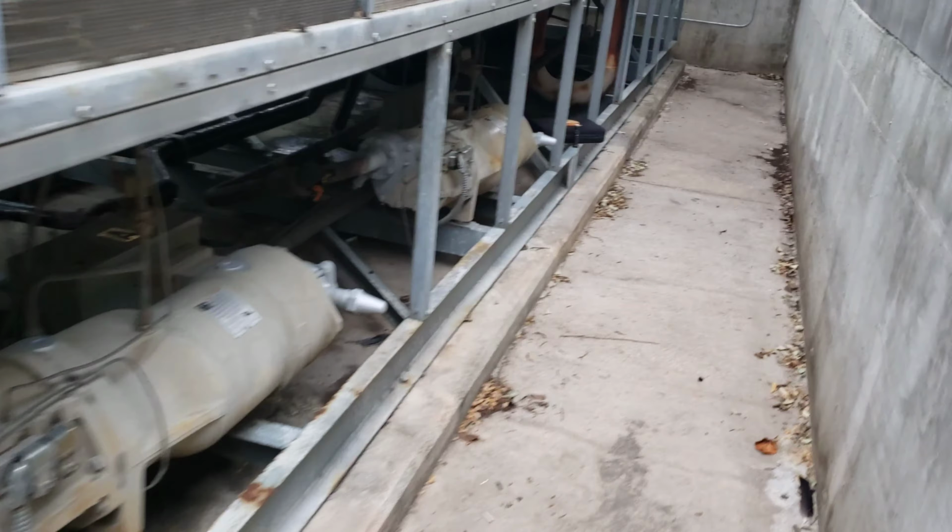So going through this air cooled train, the problem he's having is every time compressor C tries to run on these cool mornings, it's tripping on a high pressure, and this circuit is cycling significantly when it shouldn't. Everything I've seen so far, this thing started at a really high starting amp,